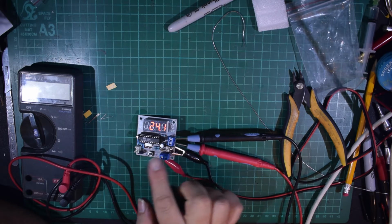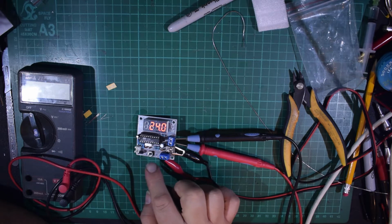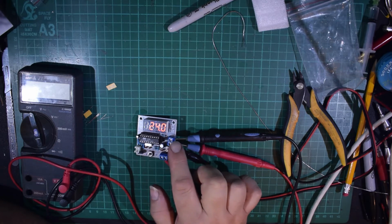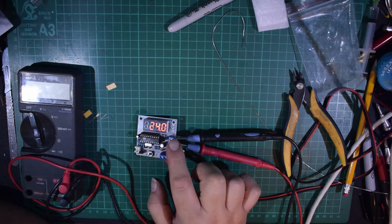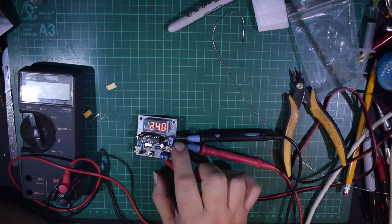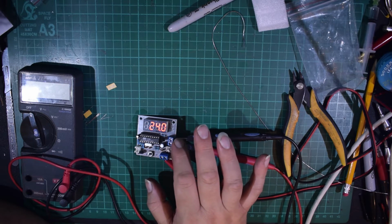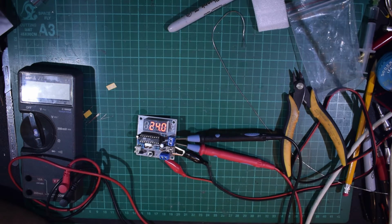I can see one of the ideal applications, if you are monitoring the internal temperature of a piece of equipment, would be to actually have that attached to a heatsink and this attached to a transistor which would control a fan, which would run, say, at 12 volts or 24 volts, whatever the fan voltage was, and you just use the transistor to switch on the fan itself. So, yeah, a very good little switching board, actually. I might incorporate that into one of my existing power supplies just to keep it a little bit cooler.